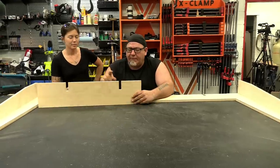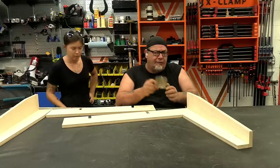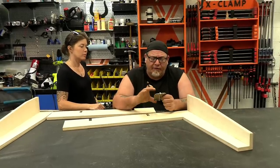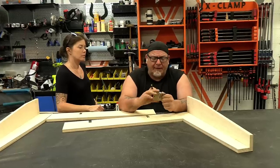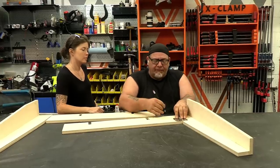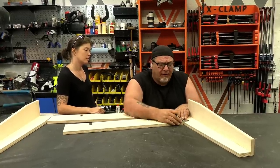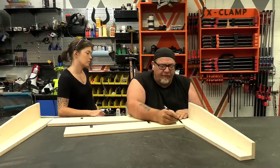So just like we cut the other cross members, these are the pieces that are going to make this whole thing fold up. We need to use some hinges. These are some solid heavy-duty door hinges, three and a half inches tall, and we picked ones that don't have a lot of play when they're open. This section here is about seven inches tall, so if I install those on the bottom, even when I'm using a big saw there's no chance the saw blade would cut through and hit the hinge. So I'm going to lay that out center mass and then chisel that out.